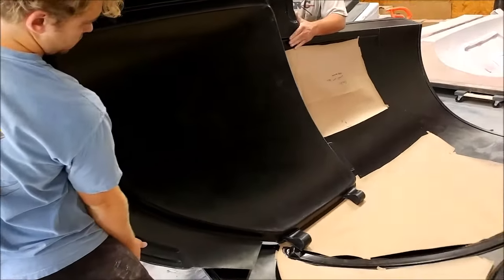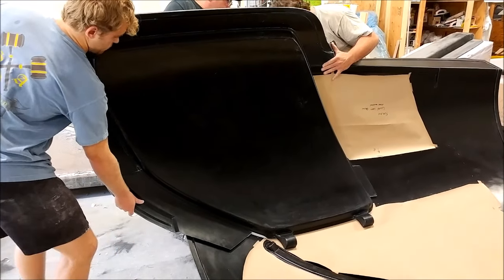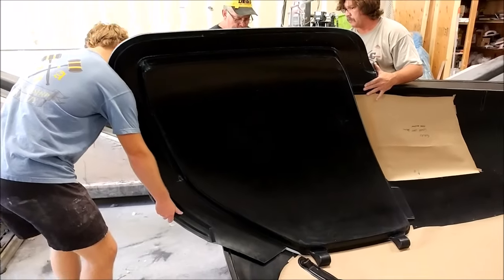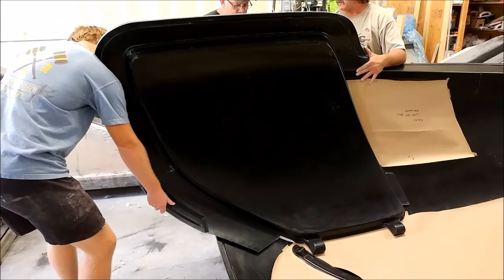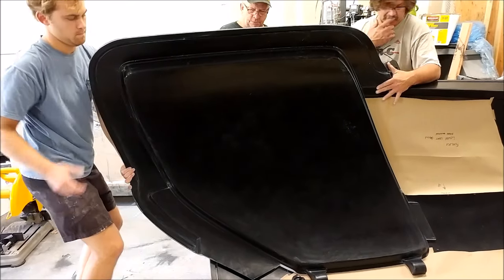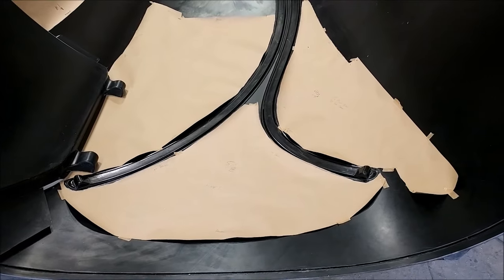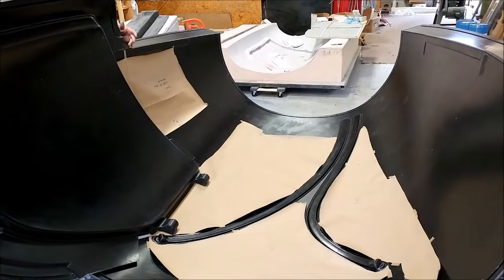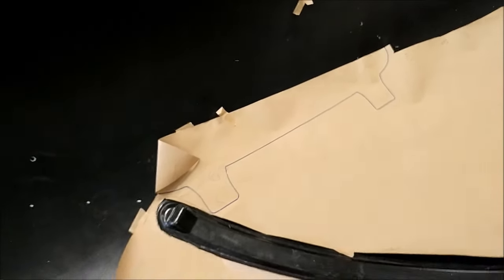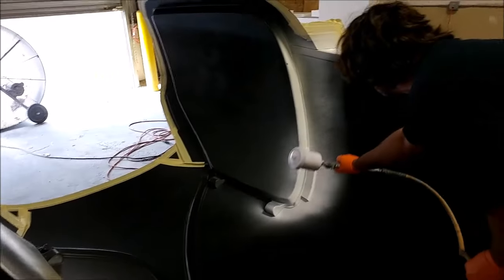Here's the upper fuselage mold with the door inserts. We've got some brown paper down there that we're using to size up the core — we have core on the roof and on the sides below the side windows. By putting the door inserts in there we can trace around those and make sure the cutouts are there for the hinges and the rear edge of the door. That gave us a nice reusable template. We have to split the core into left, right, and center around where the channels are where the parachute straps lay.